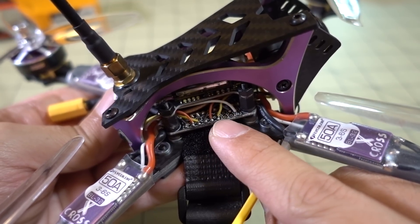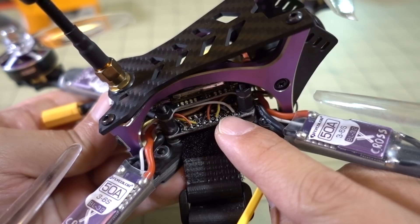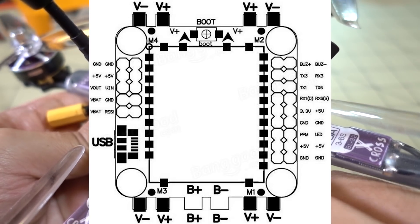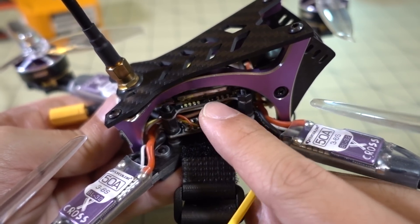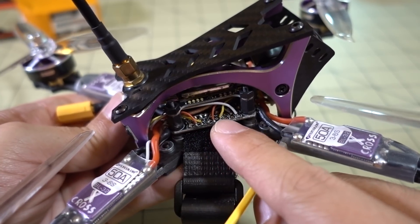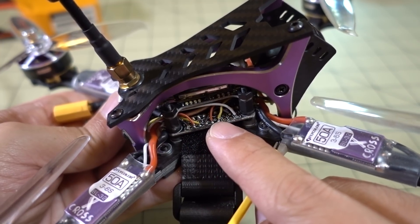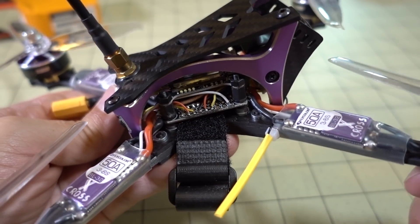You definitely want to fix this before flying. I moved the blue wire, which is the VTX remote control line, and hooked it up to one of your UARTs — specifically UART 3 on the TX. I'll put a diagram on screen showing the pinout for this board. This board and video transmitter are pretty common parts, and I'll put links in the description. It's an F4 flight controller with an Omnibus BetaFlight OSD and a built-in PDB. The ESCs are connected and there's a current sensor as well.